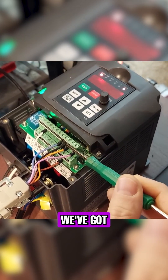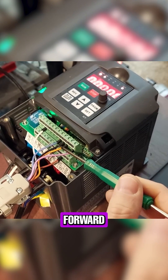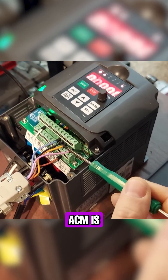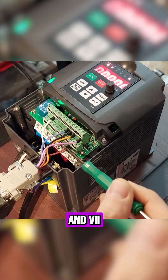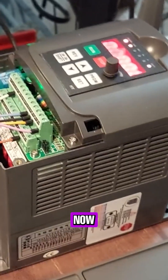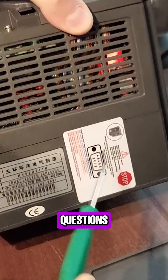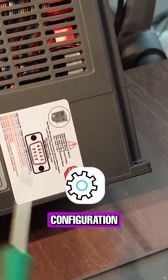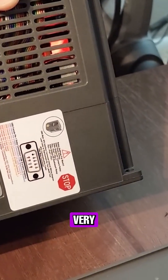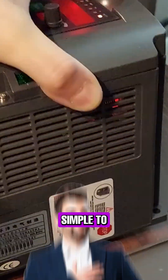White lead is DCM. We've got a reverse lead for blue. Forward is black lead. ACM is orange lead. 10 volts is purple lead, and VI is brown lead. Now if the client has any questions as to what is what, everything is allocated here in color configuration, so it's very simple to hook up and very simple to work with.